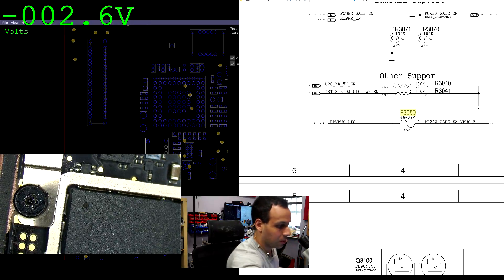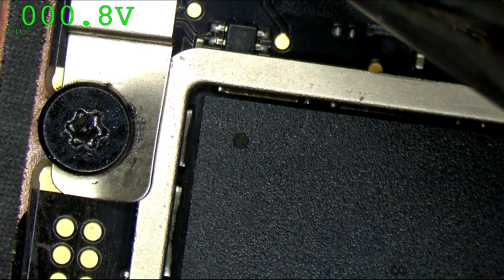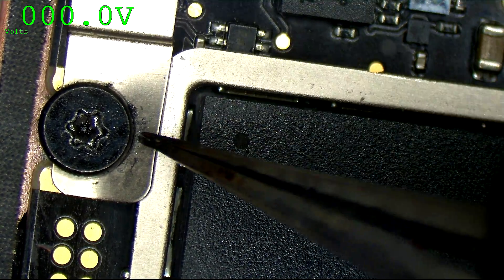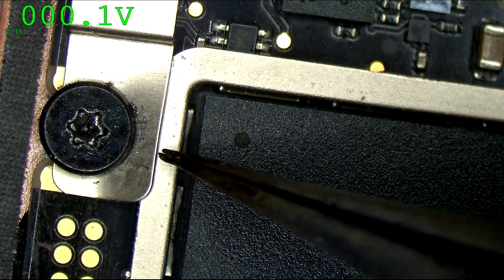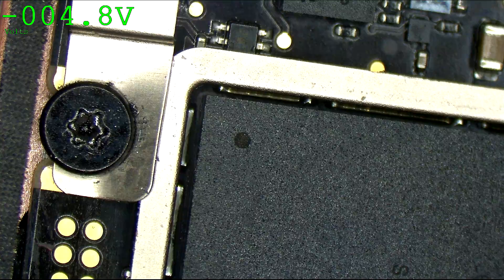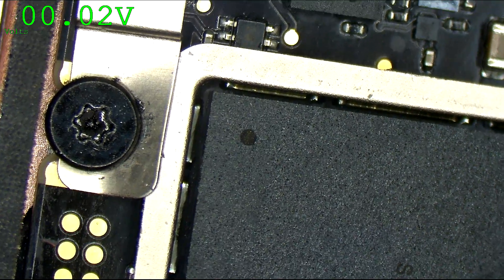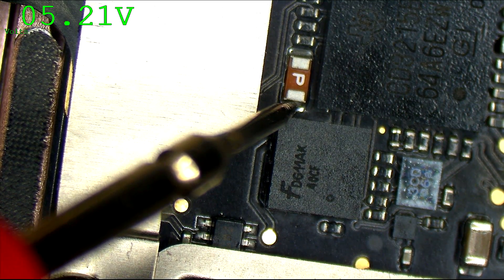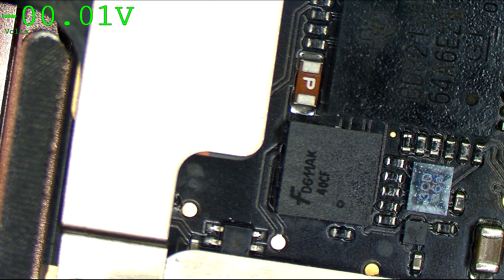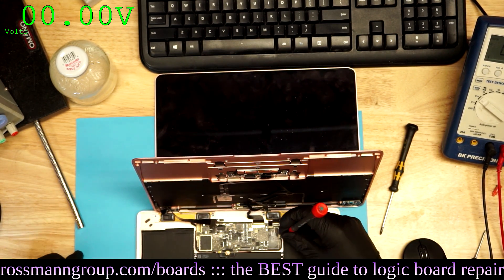As you can see, we have some mall messery over here. This does not look like it's plugged in right. This piece of metal, instead of being slid under here, is screwed right over this — it's all bent. At the input fuse we get 5.2 volts. We're supposed to be getting something along the lines of 20, which means that communication is not occurring. Mall shops are, not all the time but a lot of the time, the worst.